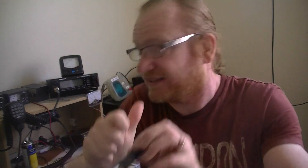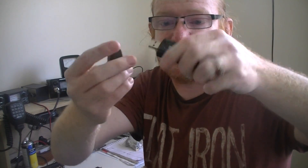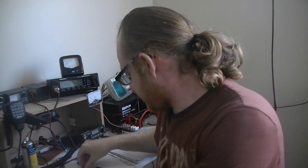It's basically an RTL-SDR but much better. That's your normal RTL-SDR that you can get — it's essentially just sold as a USB television receiver dongle. Now it's a DVB one, but just ignore that entirely because we're not interested in the television receiving capabilities of these things. It's not particularly well built for receiving anything to be honest, because there is actually no screening on this case.